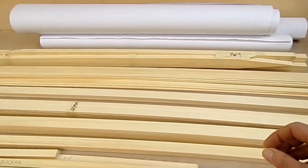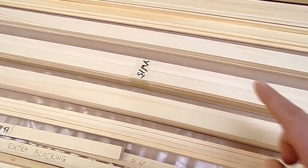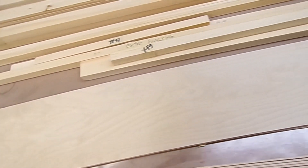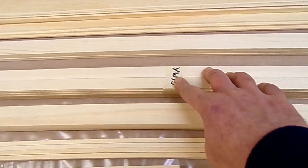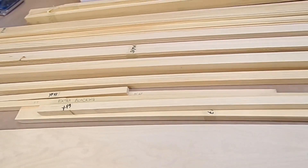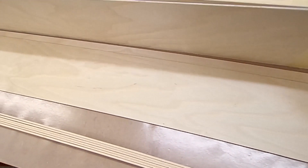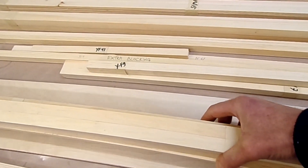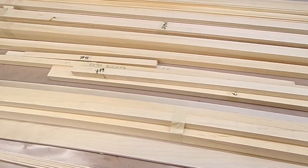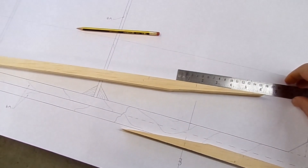Looking at the wood material: lots of spruce, lots of strip wood, all labeled. The labeled marks refer to various parts on the plans — if it's got a W on it, it's for the tailplane; if it's got an F on it, it's to do with the vertical fin and rudder. We've got good quality plywood strips for doing the gussets and closure panels. The spars for the tailplane come slightly shorter, which reduces the shipping cost by a huge amount — they've been cut for scarf joints, and you need to scarf them together to get them to full length.